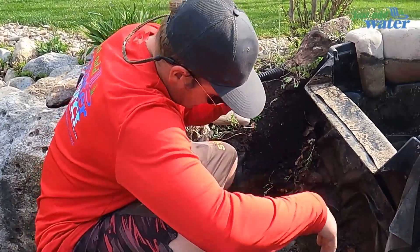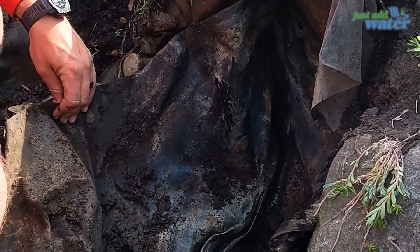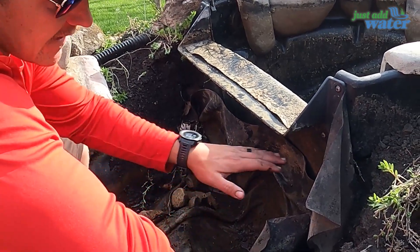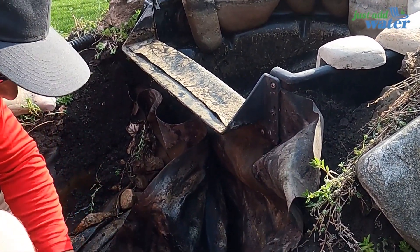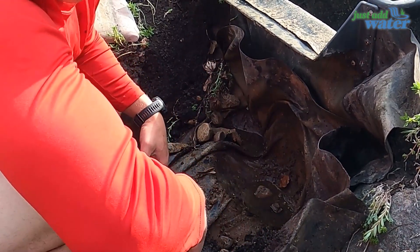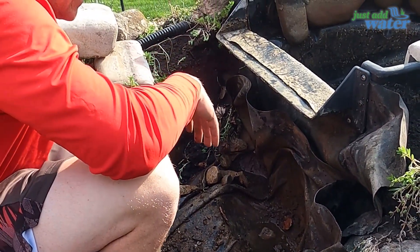What we have here is a situation. This liner here appears to be the actual stream liner that goes down. Normally what we like to see is this liner that is attached to your box needs to flop over the face of it, so any water that comes down here goes on top of this liner and proceeds to go down. That could be part of the issue — other than the identified water loss — it could also just be old liner with new pieces put on it. There's a lot of low liner down in here, so we're gonna follow both sides to figure out how it's working and whether it's proper. We're gonna continue to tear this out, probably cut down some of this dirt, which will make the rockwork trickier, and then we'll take this off, reseal, and put it back together to make a waterfall.